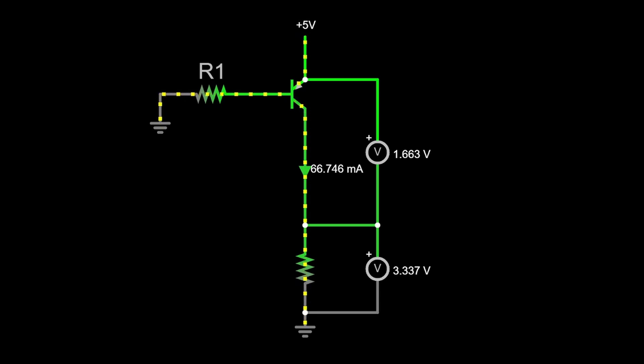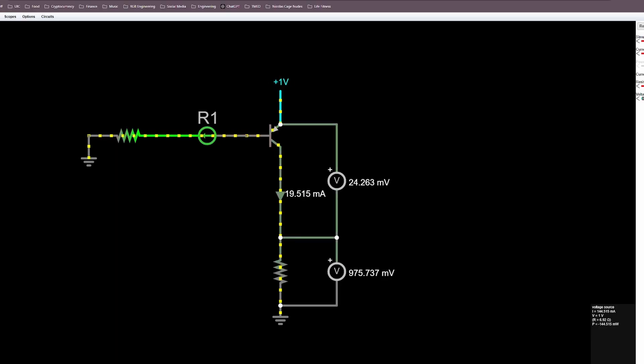For example, if we want to convert 5V to 3.3V, and we know our load resistance is 10 ohms, then we need to allow 330 milliamps of current to flow through that load in order to get a voltage drop of 3.3V across it. Kirchhoff's voltage law will always apply, so the total voltage drop across the entire circuit will equal zero. This means the greater the difference between the input voltage and the output voltage, the greater the voltage drop across the transistor has to be.